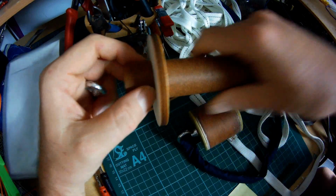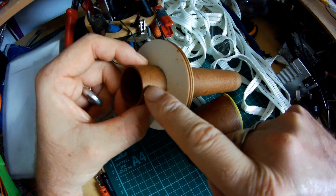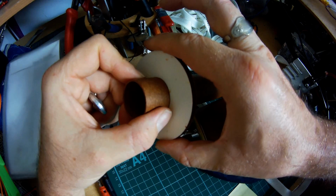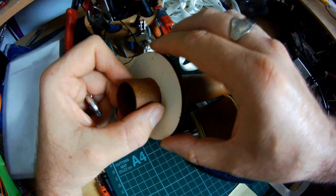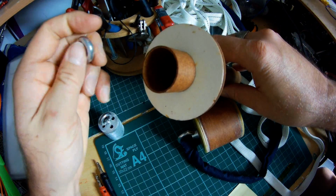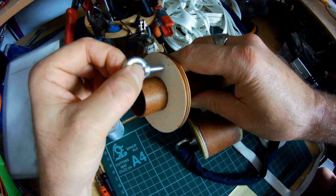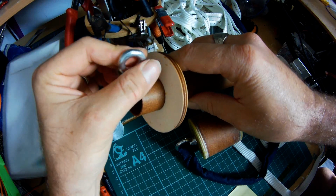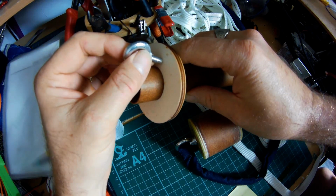More commonly for structural points for recovery, if this was a 29mm motor mount tube, but it was going inside a 76mm airframe, this is the centering ring that would be glued to both tubes, and there'd be a couple of them, maybe even three, and you can see that you've got loads of room here to drill a hole and to mount a nice lifting eye as a secure recovery system mount point. You've got loads of space to do that.